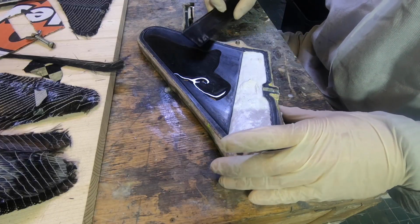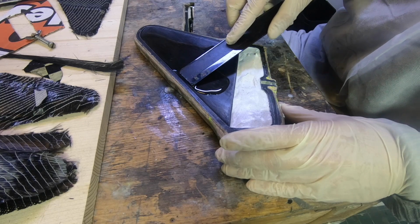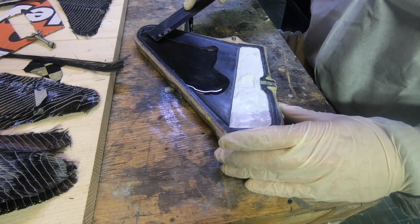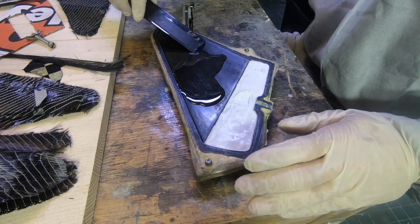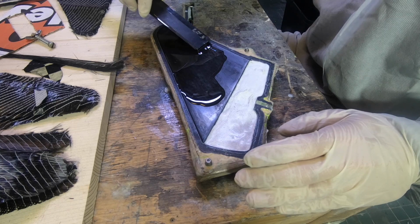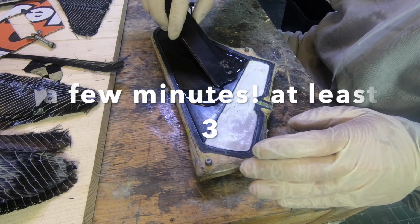And then I put a lot of resin here in the surface area of the fin. This is the most important layer because it's the only layer you will see later on. So make sure the resin is really everywhere and the air bubbles have time to leave to the top. So I distribute it and then I let it set for a minute or so.